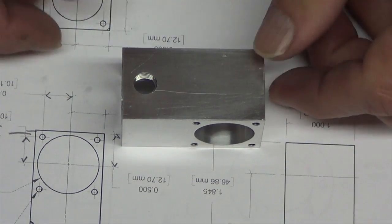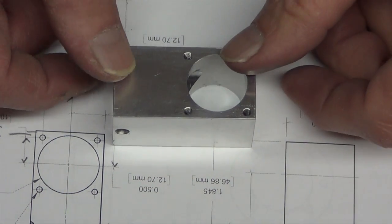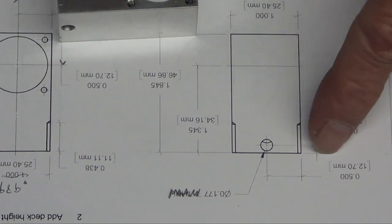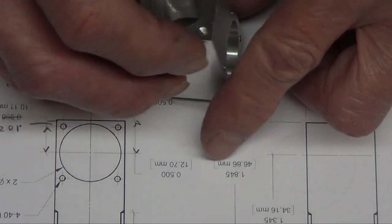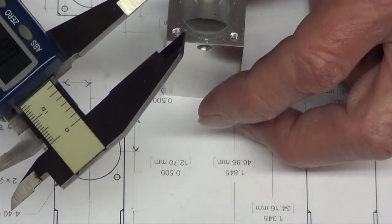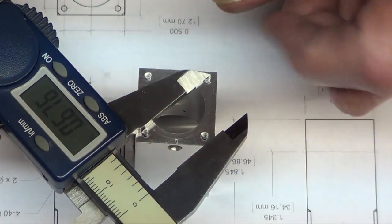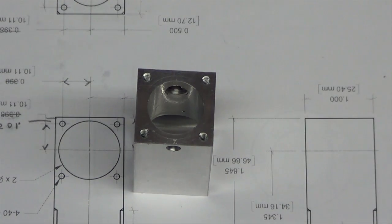I haven't done the surface yet on sandpaper, because I know I've still got to do this angle piece that they show right there. And for that they want a radius of 0.675, which isn't much, because I set this at 0.676. Did it in the camera view. So if I go across the center of these holes, you can see I'm just barely clipping it. And they want it rounded. I could put it in a 4-jaw, but I'm not going to.